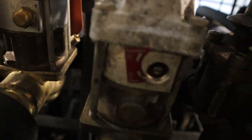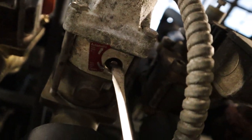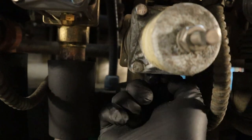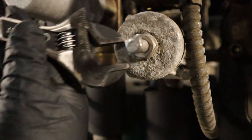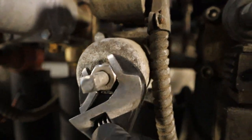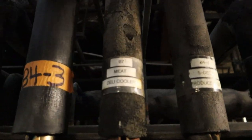So again, like always — make sure this is always back to auto. If you ever touch it, just make sure you go back to auto. You don't want one of your fellow technicians coming back because it's iced up, cursing your name because you left it at manual. Make sure that's back to auto and tightened up. Also tighten up the lock nut so it won't vibrate loose and the adjustment won't be off. Righty tighty. Make sure everything is tight — nothing loose. B7, let's check it out.